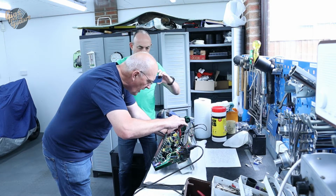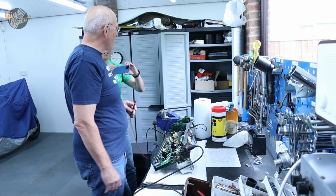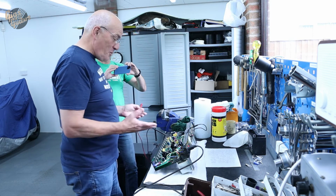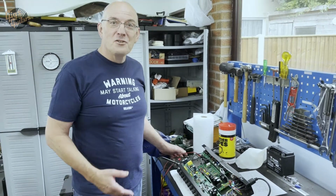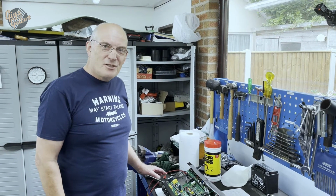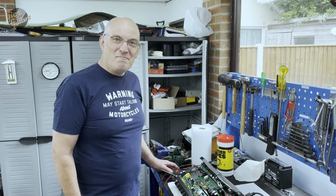And on the anodes of the output valves, 357. That's very good. You'd probably expect getting on for 100 volts higher than that on EL34s, but these are just the small B9A EL84s. You used to find these sort of valves in tape recorders and record players and stuff like that. But I have to say, that sounds a rather healthy 20 watts, doesn't it?